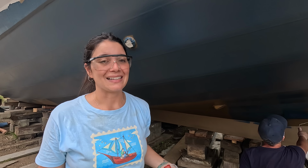The entire boat has one layer of anti-fouling on absolutely everywhere. What we did do is underneath the keel, we just went under to put a total of 3 layers, because soon the cradle is going to go on and we won't have access to some points under that keel. We don't know where, so 3 layers under there. If anything, we can add some more when it's on there.